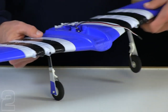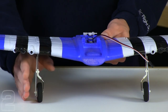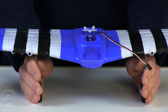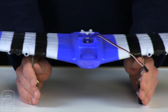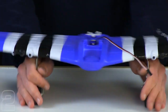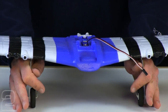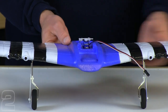You're going to want to check the alignment of both wheels as well. Looking at the nose of the aircraft, you're going to want these to be parallel to one another or even slightly toed in, and you can twist them slightly in the bracket to where they're just slightly toed in. This is going to give you the best handling on the ground — toed-out wheels will make it want to zigzag. With a slight toe-in, it tends to track more true and won't wiggle when you taxi or come in to land and roll out.